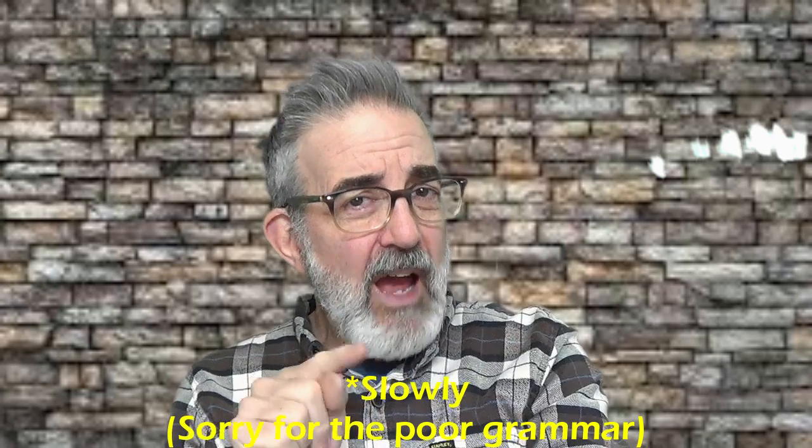I just wanted to show you the simple way to take up a little bit of space on a lockback. You can't do it on the Ultimate Hunter because that has its own patented locking mechanism, but on your Buck 110s and any old-fashioned regular lockback, this should work just fine. Give it a try, go slow — you can always tap a little bit more, you can't untap. Remember that. If you do go too far, you have to get out the files and be really super careful — that's a complete pain in the keister.